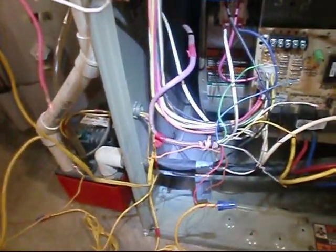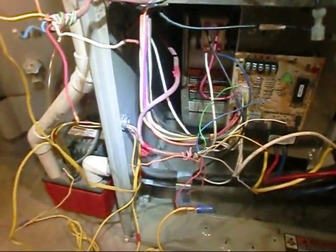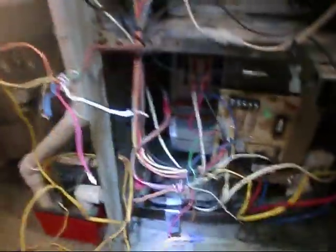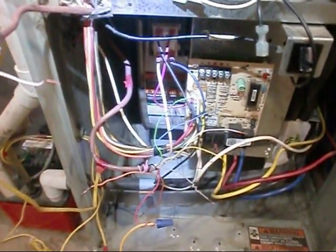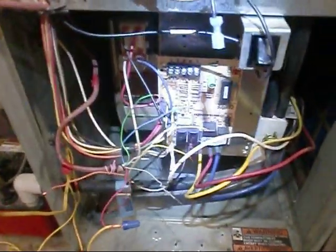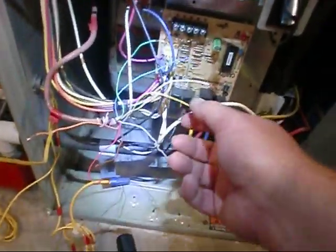This is a ninety percent furnace so it condensates. The pump is actually functioning in the winter time also. I've got my yellow broke down there for that secondary drain — the only time it's going to be functioning is in the cooling season. I've got my outdoor sensor so I can tell what temperature it is outside on my thermostat.